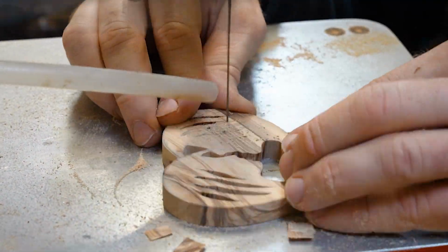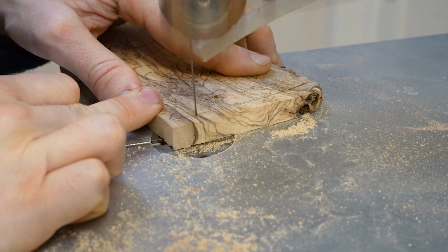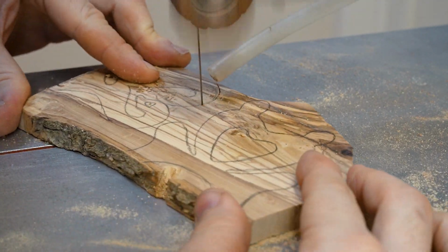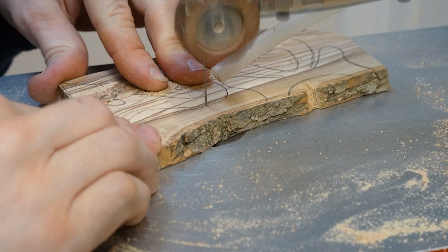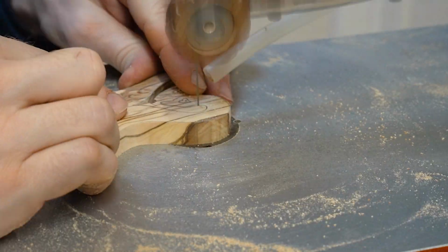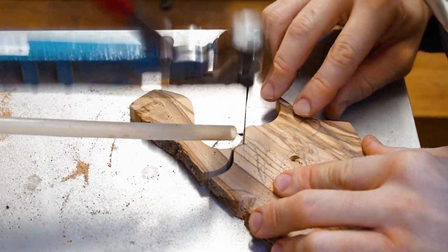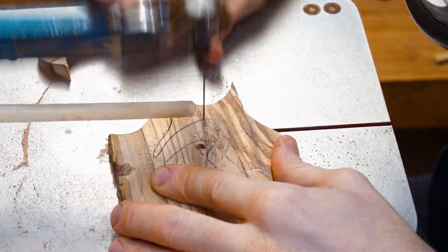Focusing specifically on these projects that we're sharing, they were great fun to make. You get that lovely character in the wood, especially the olive wood. The mahogany, you have a nice grain, but the olive wood, you have such beautiful contrast in those colours. And by using that pierce work, we have the contrast of the light and the shade. Start off by scroll sawing around the outside edge to get a profile of the project that you are working on. You then start doing the internal cuts. Now there's all sorts of different methods and different ways that you can approach this. We start off by cutting the outline, and quite often I'll cut the outline of all the projects, and then afterwards, one by one, we will do all of our pierce work.